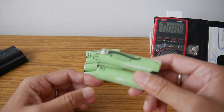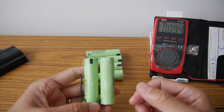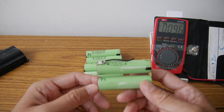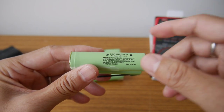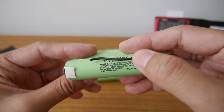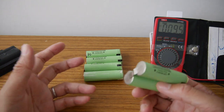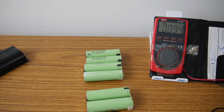This is fully charged. Actually, I recommend you discharge it to 3.7 volt to make it like a 10% or 15% battery. A fully charged lithium battery has very high energy, especially this very good type. In Japan, this is Panasonic. Actually, it doesn't say, but when you Google that, you will know this is a Panasonic battery. It's very good, high power. So if you do what I'm doing, I recommend you discharge it, so there is less risk. Okay, let's start.